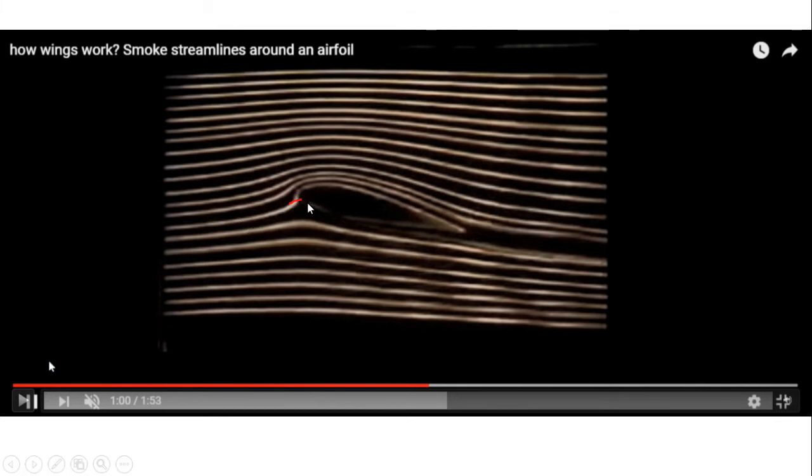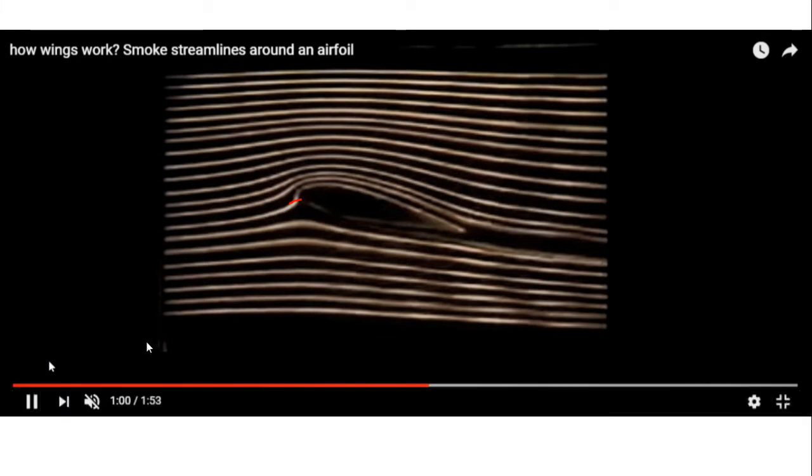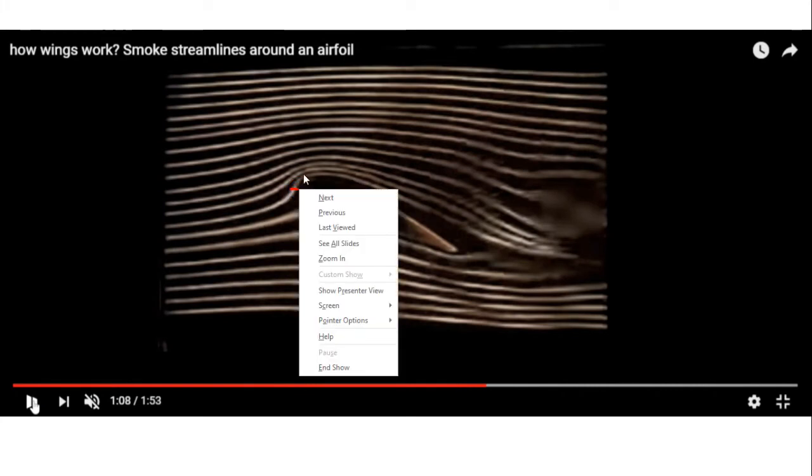There will come a point where, with that little switch still sticking out into the wind, the airflow now comes up and pushes the switch up. That completes a circuit that sounds the really annoying horn, telling you you're getting close to the angle that will cause a stall. It's actually a three-position switch: a slight wind activates the first sound, and if the angle of attack increases even more it moves to the top position, giving you that really high-pitched sound throughout the stall until you recover.